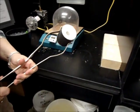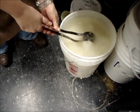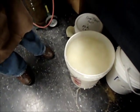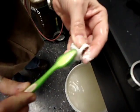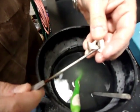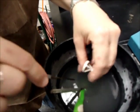I'm going to take my flask with the silver ring in it and quench it in a bucket of water to break up the investment. It bubbles off most of the investment so I can get to it and remove the ring, which ended up in the bucket. This is what it looks like when it comes out of the investment — it's kind of dirty, full of the mold material, which I'm going to clean up using toothbrushes and picks to get all of this mold material off of the silver. When I am done with this, I'm going to clean the silver in a mild acid bath called Pickle.